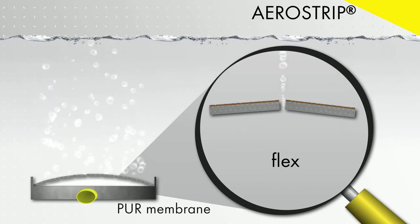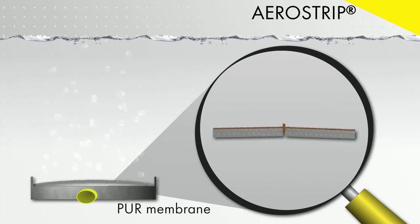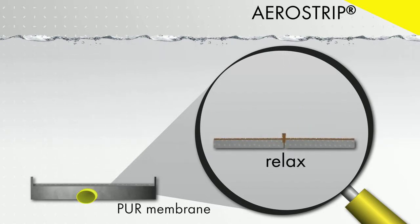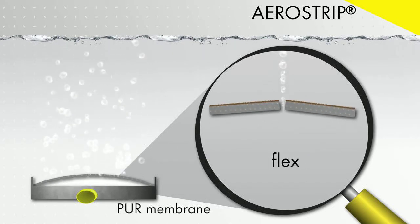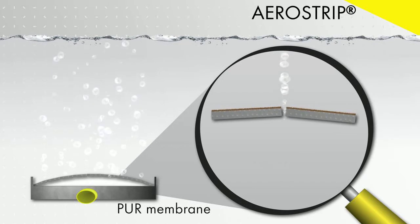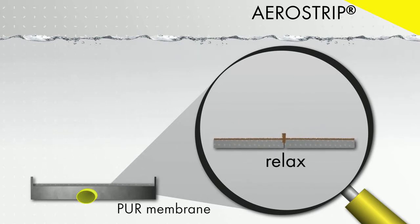During this relaxed step, the pores will loosen the biofilm growth in the openings and make the flex cycle much more effective in clearing the biofilm from the pores and preventing this fouling from occurring over time. This relaxed flex cycle is recommended daily and is typically completely automated. The duration of the cycle is generally between three to five minutes in length.